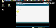In the setup program, making sure we comment everything, we're going to initialize the digital pins as outputs. All the pins on the Arduino can be used as both inputs and outputs, and we'll talk a little bit more about how you actually do that. But for right now, if we're outputting to an LED, we're turning an LED on or off, we want to make sure that LED pin 13 that we said before is set as an output.